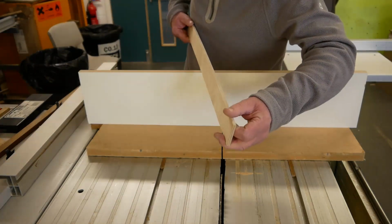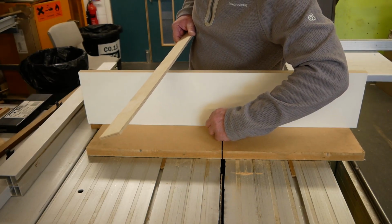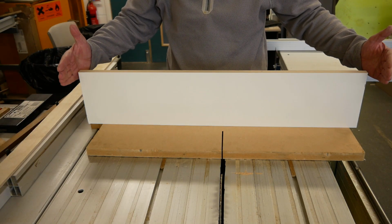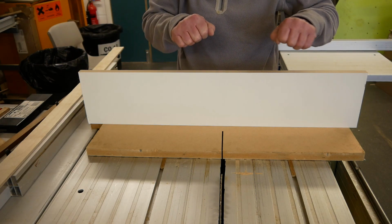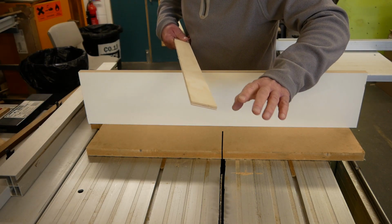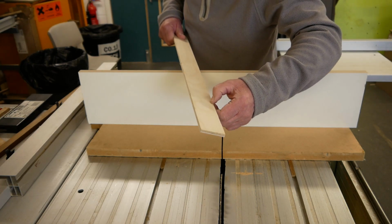So the material we're going to use is this 6mm plywood. I want joints that are 25mm apart, running up the total length of the height of the carcass, which will be 700. Any smaller, I think I'll be cutting joints here forever. But 25mm is going to give us a very large gluing surface, and if I cut them accurately, I think it's going to be very strong.